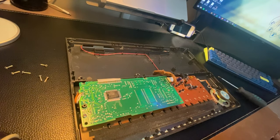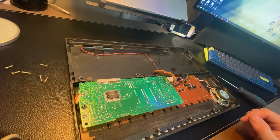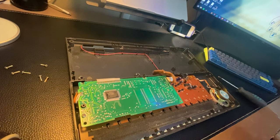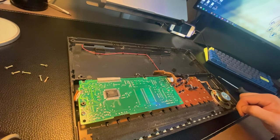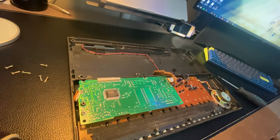All right, so we're going to attempt to cut this wire that goes to the speaker output, but we're gonna notch this here and here. We're gonna put a switch in somewhere here, and we'll put a jack in somewhere here, and then we'll put it all back together. And what we'll be able to do is intercept the signal from the board to the speaker, step it down and send it out line level. And then have a switch over here that we can choose either line level or speaker in case you wanted to take it out and be portable. We're gonna keep its portability and its goofy sounding onboard sounds.